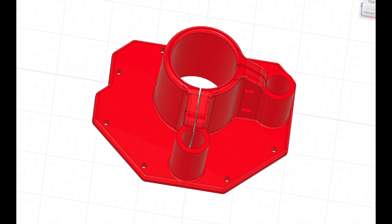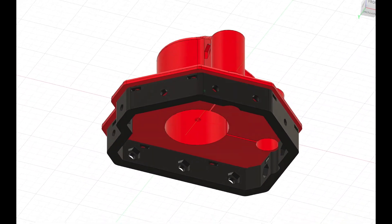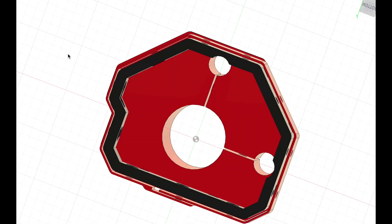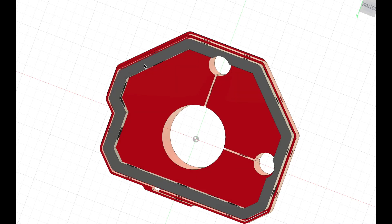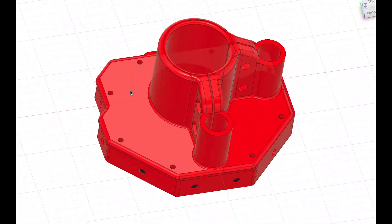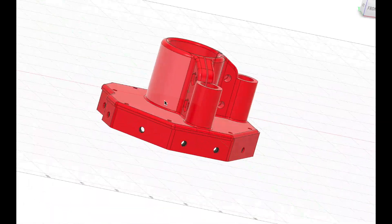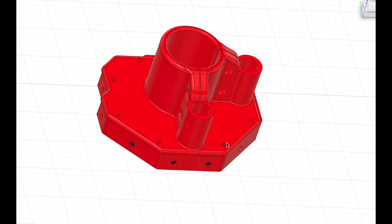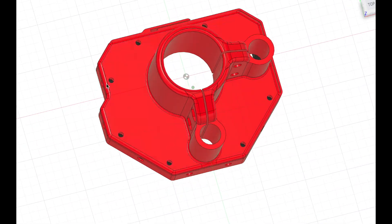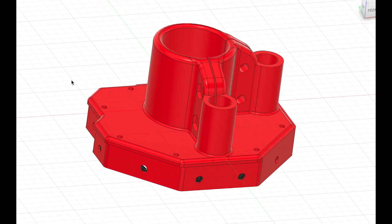To this main body we attach a rubber holder ring underneath. An outer ring holds the rubber to the inner ring like a washer, and there is approximately one millimeter of space. The ring that holds the rubber is attached from the top with screws, so the rubber with this ring can be removed from the main body from the top without removing it from the torch, if necessary.